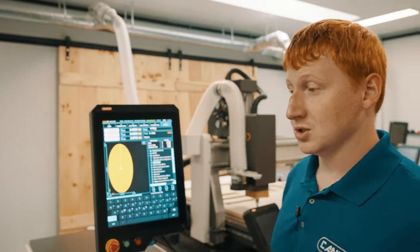You can see this indicated using your X, Y, Z positions, the feed rate at which it was moving, the tool number, as well as the spindle RPM. To run this, we'll just simply hit the run button, followed by pressing the cycle start button. Typically, this is 3 times to allow the machine to line up X, Y, and Z independently to make sure that the alignment is correct.